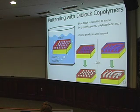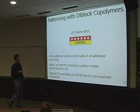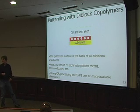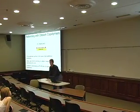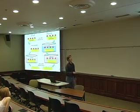And then you can go in and process these voids with, for instance, a plasma etch that etches down into the material and leaves this nice surface that has polymer left in some places, but not in other places. And here's the key. Once you get to that stage, it turns out you can make anything that you want. For instance, here are a couple different ways to go.